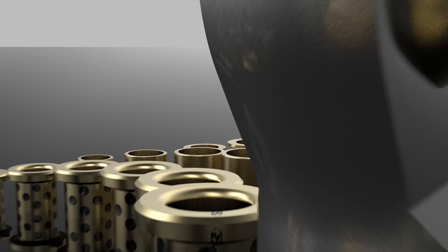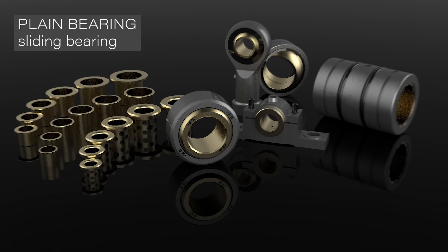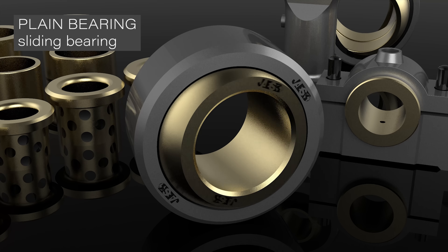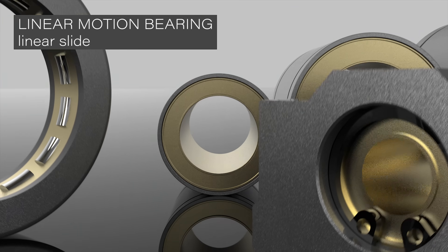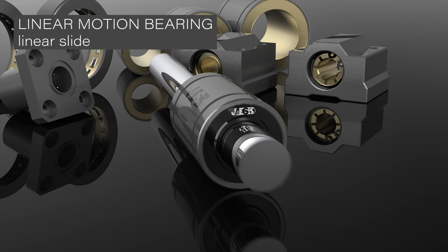There are many types of bearings. The most common ones are plain bearings, also called sliding bearings or slide bearings, which are made of two different parts and don't have rotary elements. They work thanks to a thin porous bronze foil covered by a layer of Teflon, placed between two elements of the bearing. These bearings are built to withstand high loads and can also bear misalignment. Linear motion bearings are designed to provide movement in one direction — they are usually called slides, and there are both linear ball bearing and linear roller bearing types.